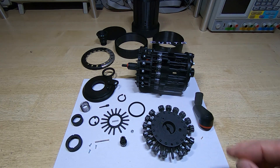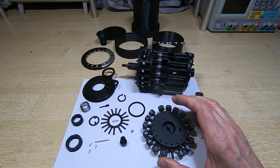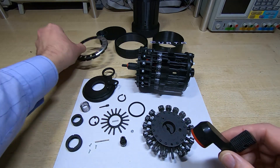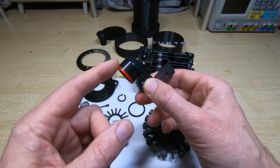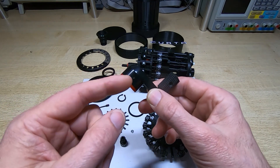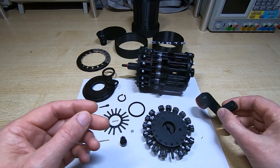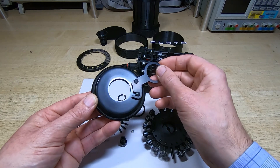The overall size of the parts is surprisingly small compared to the x3 unit. Rather than painting everything, I've painted a few parts where multiple colors were needed — for example, the top ring where I needed black and silver is painted. But for some other parts like the crank handle, I used a dual-nozzle printer with red PLA in one nozzle and black in the other. So instead of a separate ring like on the larger unit, it's all one piece, polished up rather than painted. I did the same with the clearing cover — polished, not painted — and it comes up very nicely.